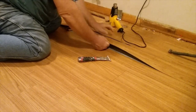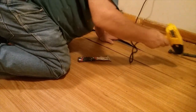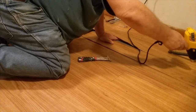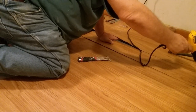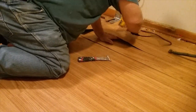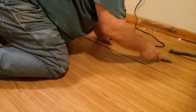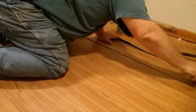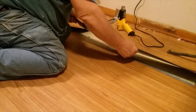Where I pulled those strips out, it'll be the same way when you do your floor — if you'll just be patient and keep your heat gun moving, slowly heating. And don't lay the heat gun on the floor like I did. Luckily it didn't damage the floor — this area here will be under the stove and the freezer anyway, but still you don't want that. Once you get them, they'll come out just like this — put it to the side and start on the next piece.